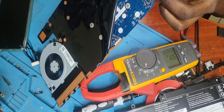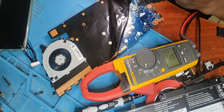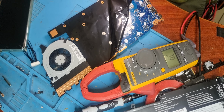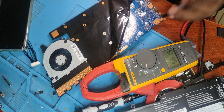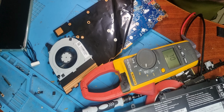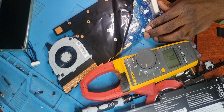So yeah, I think I'm okay. I'm not so confident about these MOSFETs, but they're okay. Back. So I'm gonna check the fuse as well, if it's not blown. And the fuse is fine, like the rest, there is no short on the circuit, like the rest. So I'll just let it cool down a little. I'll try forcefully do that by applying this spray. And then cleaning the physical flux out.